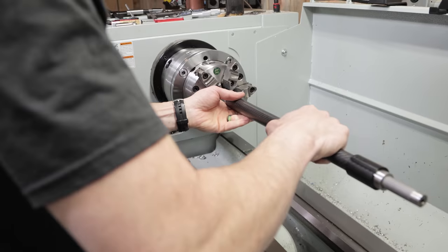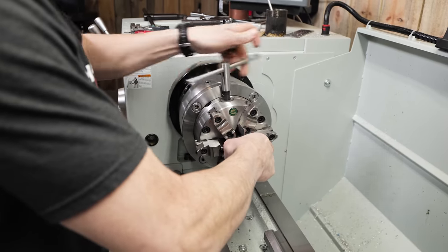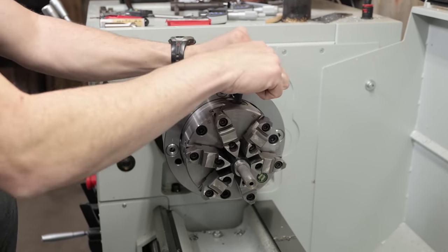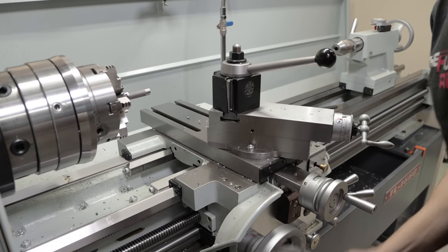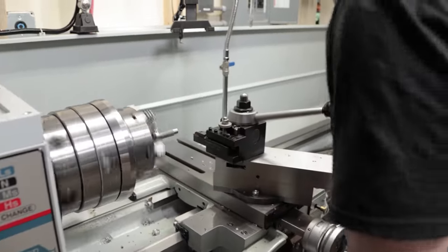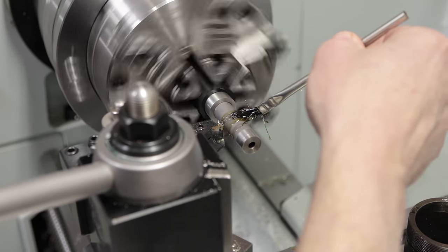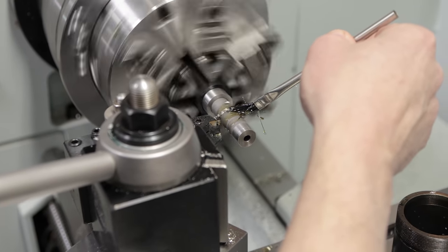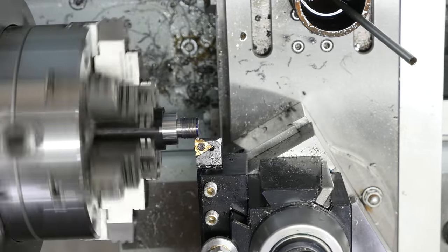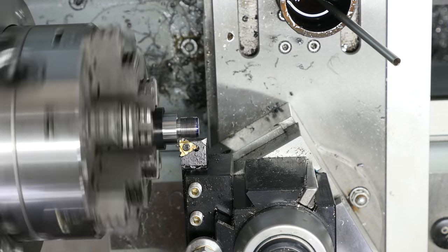I went onto the muzzle work. I put my sleeve on and clamped it down in the six-jaw chuck — it's part of the Truebore alignment system. I used my SSG range rod with two bushings that ride inside the bore, giving a nice cylindrical rod to work my indicator, get my axial and radial adjustments dialed in, and proceeded to thread this 5/8-24. I like to recess the crown a little bit for protection, got the thread pitch and diameter just perfect, and checked all that.